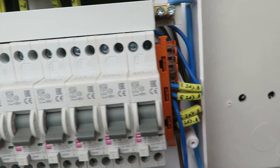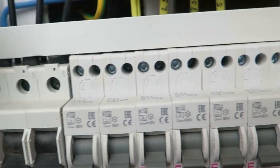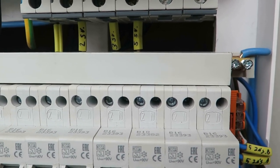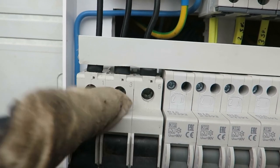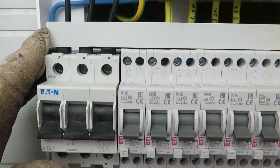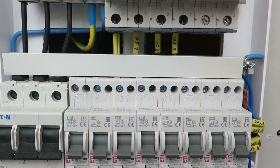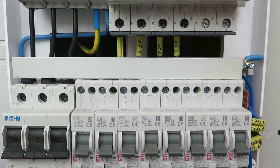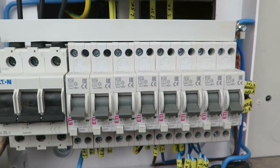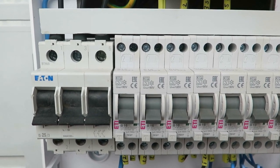So okay, I can put one wire into the one terminal. There's no space for more. So I get bus bars, and these bus bars are not compatible with this style of breakers, or even any style of breakers, really. So I was looking, okay, there is a special bus bar for this purpose. Two months to get it. Okay, well, that's not good. I need this. So I got two types of bus bars, cut them, brazed with silver.